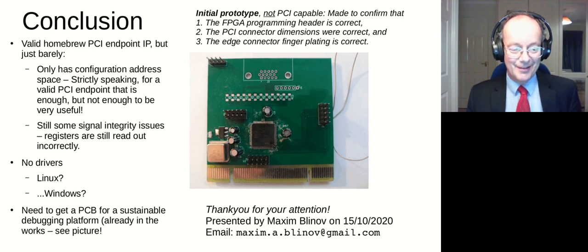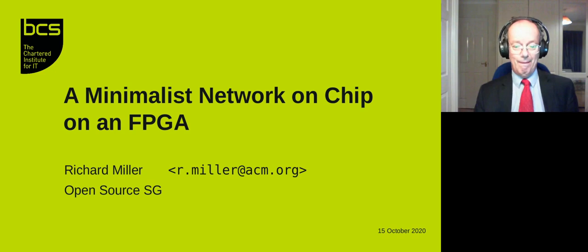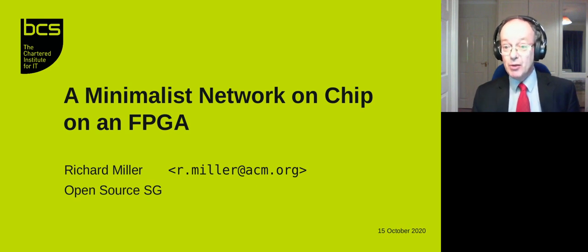Something to confess: it doesn't actually meet timing. That's why I soldered it to the topmost PCI port, because it gives the most timing slack — if the wires were too long the signals would take too long to reflect and I wouldn't be able to read a stable value. So the topmost PCI port gave me the most slack. It doesn't meet timing, but it does work. I think I got lucky on the silicon lottery — it didn't meet timing but it didn't crash itself.